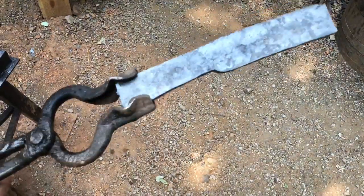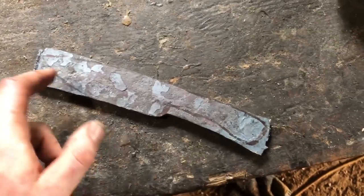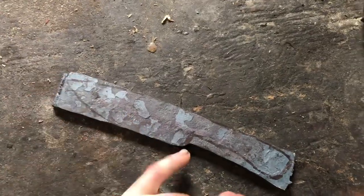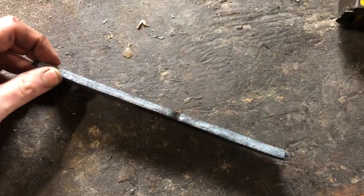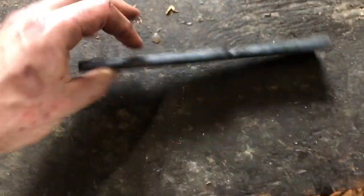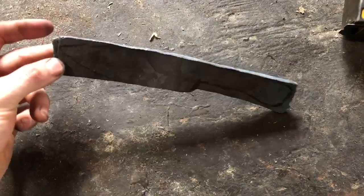Didn't have to move a lot of material to get the length I was looking for in the handle. Going to let this cool on its own, break for lunch, then hit the grinder. Got the profile I want marked out — a nice elongated teardrop-shaped handle that flows into the drop point. Before bringing it to finished thickness, I'm going to dip it in acid to see where my core is, because I feel like it might have gotten off-axis during forging. One side might need to be flattened more than the other.